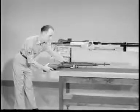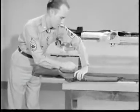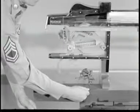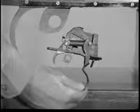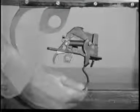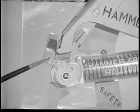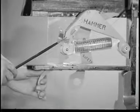Let's see how the mechanism of the rifle can be adjusted to fire either single shots or bursts. To see how the firing mechanism operates, we will use an oversized model. If the firing mechanism assembly were operating at normal speed, recoil would happen so fast that no rifleman firing single shots would have time to release the trigger in preparation for the next single shot. To overcome that, the sear is provided. The sear catches the hammer hooks even though the trigger is still being squeezed.